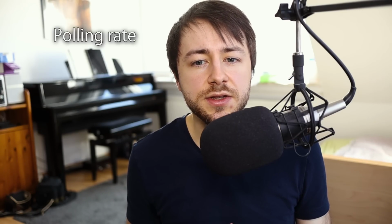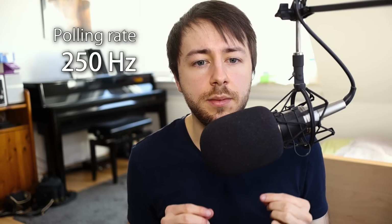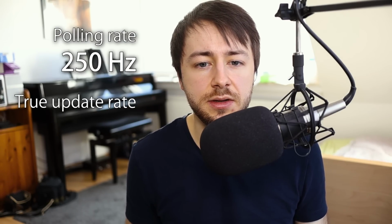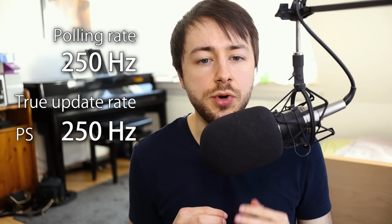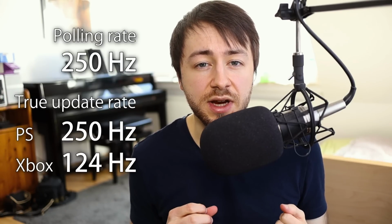The default polling rate of all the controllers is 250 Hz when you plug them in. But as I said, the update rate doesn't have to be equal to the polling rate. While all the PlayStation controllers send updates 250 times a second, the Xbox controllers do not. They report only 124 times a second.